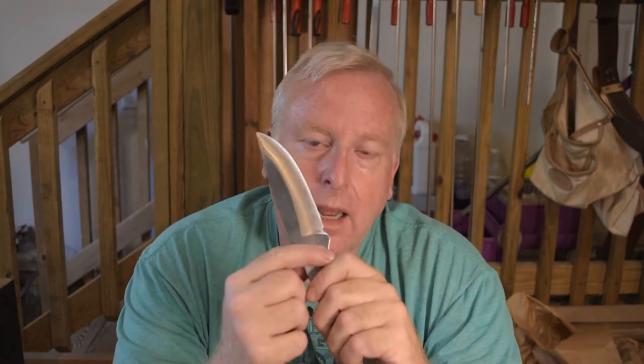So, before I moved on, I reground the bevel. I got it to where I've got a little bit of an edge on there. Nothing really, yeah, it'll cut something if you hack at it, but it's just there to make sure I had the bevel ground down enough, because once I put everything on, it's going to be really tough to put the bevel on it. So I also finished sanding the blade, so it's all ready, and now I can do a dry fit, and this will be the first time we kind of see it as a knife, and that's pretty cool.